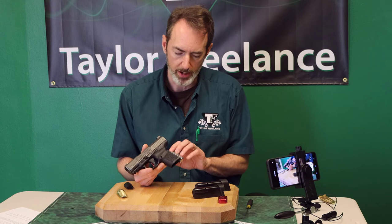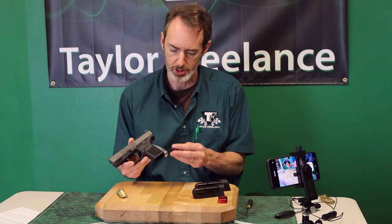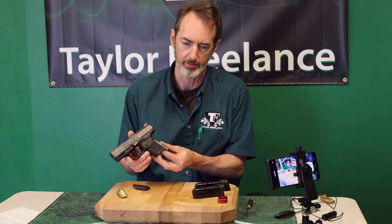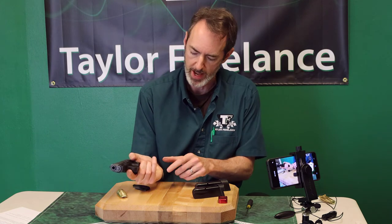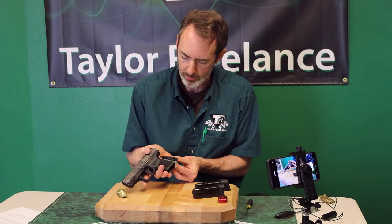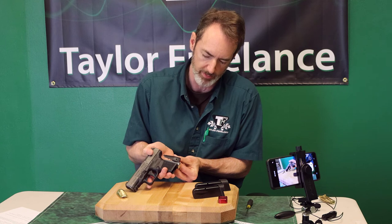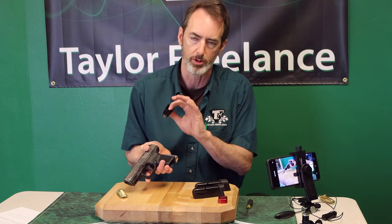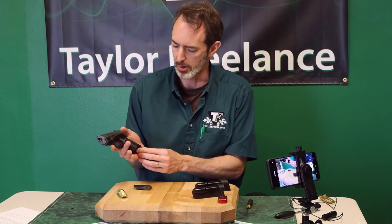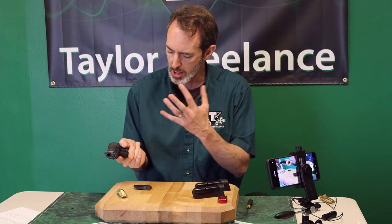When we were playing around with the overall design of the part, we wanted to get rid of that sharp point we talked about earlier. So we changed that to a curving butt that fits the shape of your hand more or less. Even though the part's really not that much bigger — we've only added a quarter to maybe a half an inch — we changed the profile of it so there's much more contact with the heel of your hand and a little more length to give you more positive control. That shape worked out really well.